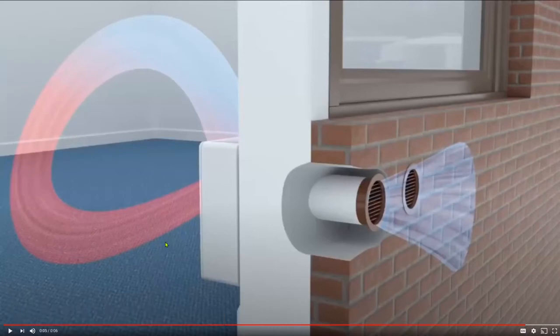So when people hear heat pump, they think it's only going to give them heat. But a heat pump works for heating and air conditioning, cooling, and it works a lot more efficiently than baseboard heating, gas or oil, because the coefficient of performance of a heat pump is typically 3-to-1. So for example, on an electric heater, I hope I'm not losing anybody, you'll use 1 kilowatt of electricity for 1 kilowatt of heat. On oil, the same thing, whatever you're putting in, you're getting out. With a heat pump, you'll typically get a 3 or 4-to-1 ratio because of the way it operates. It's way more efficient.